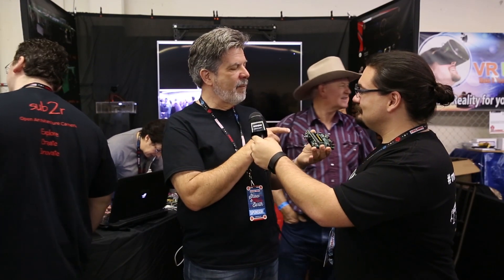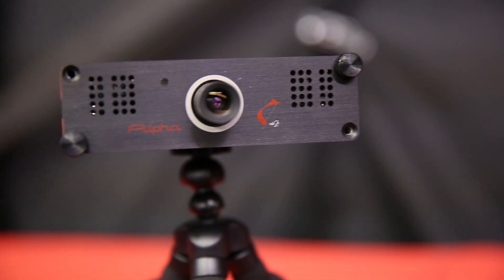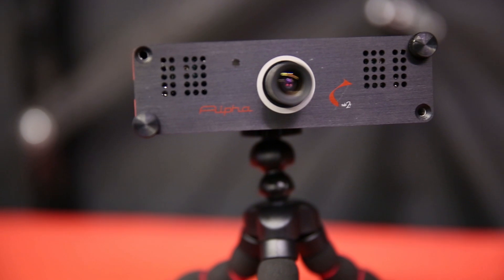We don't know what you're going to do with this, so we've tried to build in as much configurability as possible. We've got 20 expandable I/O ports on the camera board alone, which means you can add powered optics, other mechanics like a mechanical lens or a mechanical shutter, powered zoom, powered aperture — anything you want to configure.